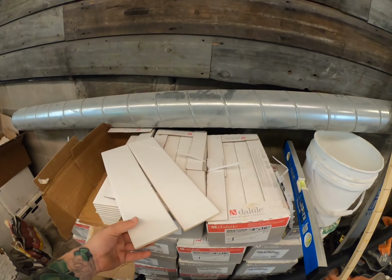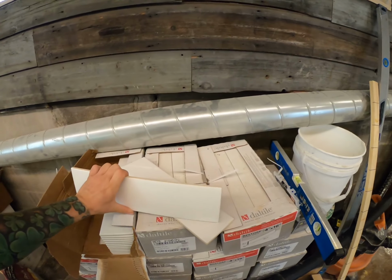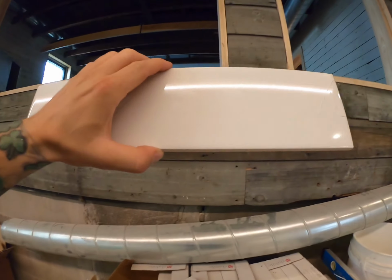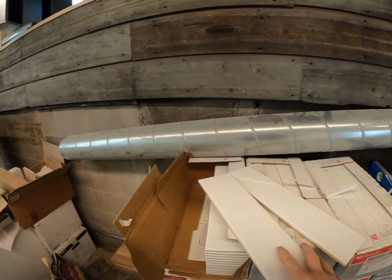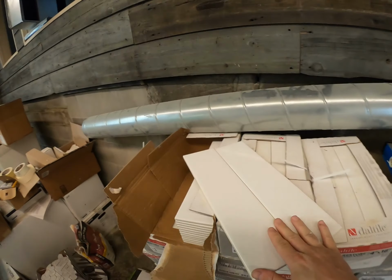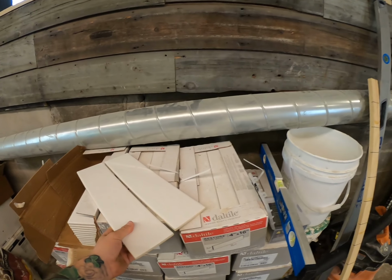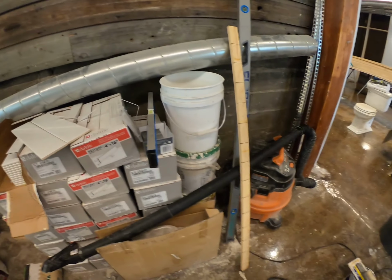First up, let's talk about the material that we're going to use. For our application here, we got this 4x16 subway tile. And maybe you can see it, but maybe you can't. But this subway tile, and all subway tile rather, has a built-in spacer that allows you to just put these tight together, and it gives you an adequate grout joint for this particular type of material. You can also have a bigger grout joint if you prefer, but most people just want that nice thin look.